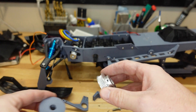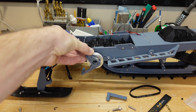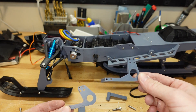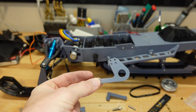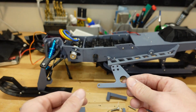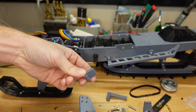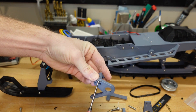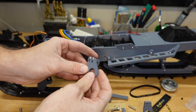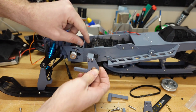We've ground a couple of millimeters off the outside, so we're much closer now to the size of the 3D printed one and it'll fit within the bracket no problem. The next thing we're going to do is choose which tensioner to use. This one is called the Hobby Print RC Tensioner Belt Support, and this one is called the Seeminator Tensioner Bracket Low Profile. This one is a little newer so that's the one we'll install today. First we figure out exactly where it's going to go, attach the rear bracket piece, add the bearing, and slide it onto the shaft.